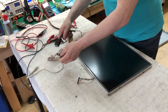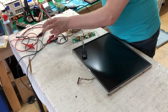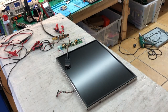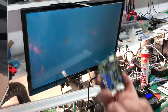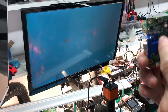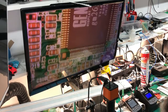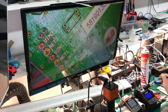I disassembled this and replaced all these capacitors. I'll show you under the microscope. We replace all of them — some are 22 microfarads on 16 volts, some are 47 microfarads on 16 volts. We replace everything with 100 microfarads on 16 volts. The bigger electrolytic capacitor is not a problem — you can easily replace with a higher value one.